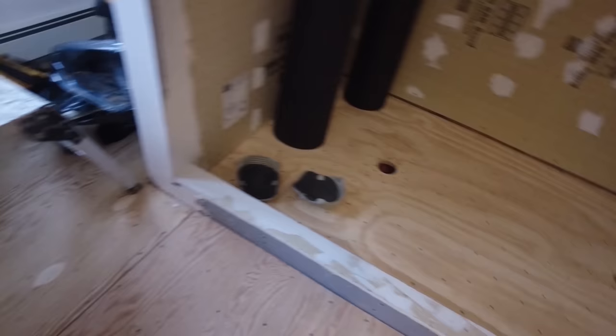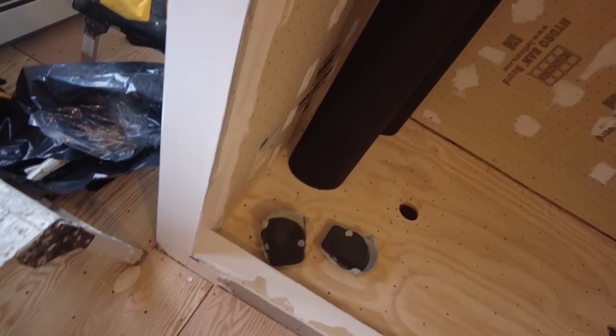Okay, so day two, I'm gonna install the dry pack mud floor in the shower. This is it. I got flow effect drains, tar paper, wire lath. Put down the tar paper, the wire lath, install the drains, install the mud.